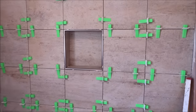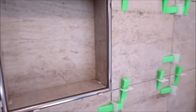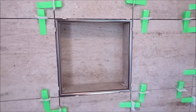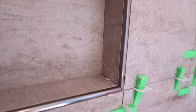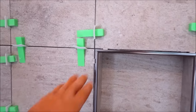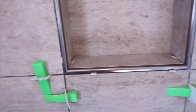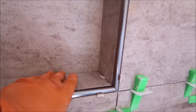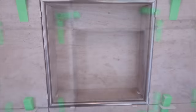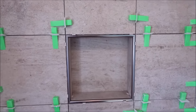There you guys go, the niche is complete. Schluter Rondeck brushed nickel aluminum trim edging profile — it's a fantastic design, much better than using quarter round or matching bullnose, much more low profile and modern. We've got clean mitered joints at all four corners, as well as our proper slope pitch to send water outside of this niche. I hope you guys enjoyed this quick video. Thank you for watching, don't forget to subscribe, and I'll see you on the next one.